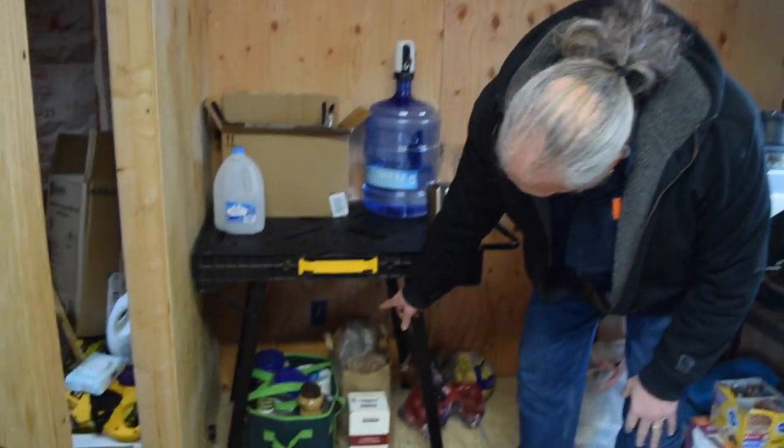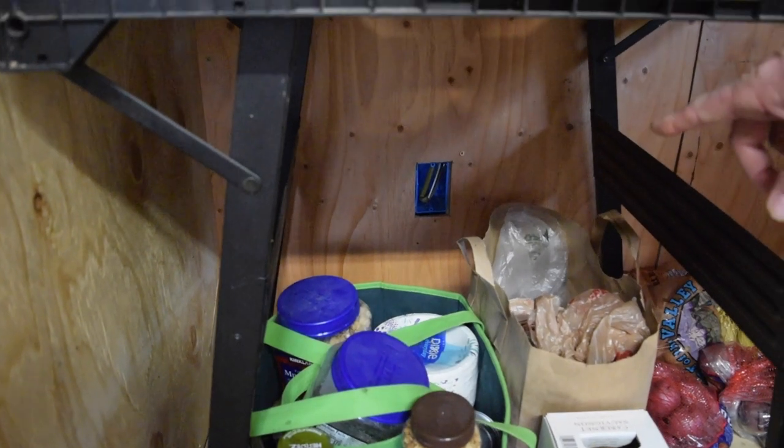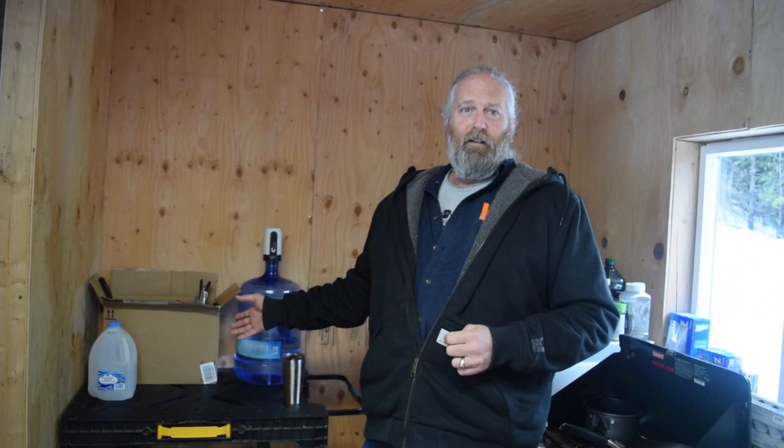That outlet under the kitchen sink will be for our little hot water tank — a two-and-a-half-gallon on-demand tank. It only makes hot water when we're using it, not storing hot water, so it's pretty efficient. It runs on 110 volts, which is nice because many other hot water tanks require 220 volts, which is a lot of power. That will serve our hot water needs for this sink as well as for the shower in the other room.